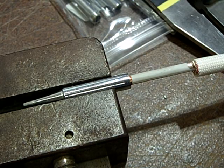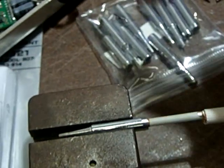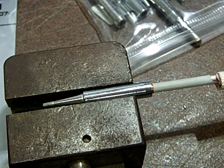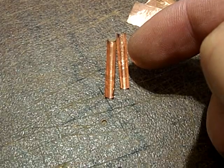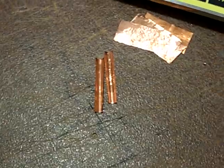As I mentioned, there are very many makers or manufacturers of both heater elements and tips, so your clearance — the air gap between both parts — may vary. But there are different copper materials available, like 0.05 millimeters which would be half the thickness, and you can also make small pieces from that thinner material to fit in if it should still be too loose with the 0.1 millimeter copper foil.